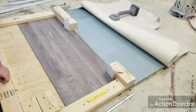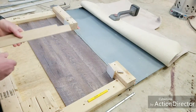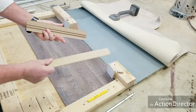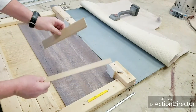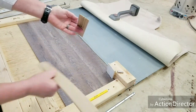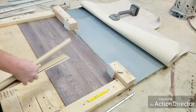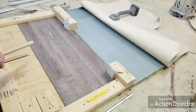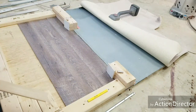Basically, how this product is made is, I guess the easiest comparison is if you've ever seen one of the little Play-Doh factories. We get the PVC, which is just a form of fairly rigid plastic in the form of beads or powder. We heat it up to a certain consistency and then push it through a mold. And we can make different shapes, T's, reducers, the stair nose, and including this carpet reducer. So it's a good, solid product, durable, and it's waterproof in and of itself.